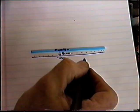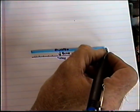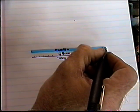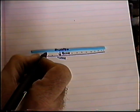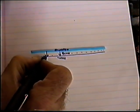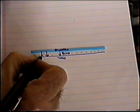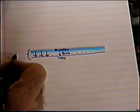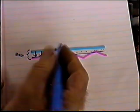Now, typically, with other finishing products, this would take 5, 6, maybe 7 coats. We're going to try to do this in fewer coats because the quality of material is that much better. It's just a better quality material than has ever been available on the market. And what I want to emphasize is to get the bond from the silkspan to the wood to be adequate using the minimum amount of dope, so that overall, this becomes the base of any good finish, and that the base doesn't wind up being, in the worst of all worlds, like this.